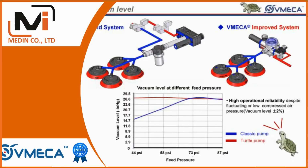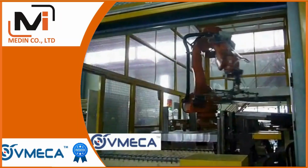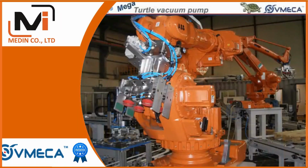Finally, we look into our vacuum level at different feed pressure. As you see, the typical vacuum system will drop in vacuum level as your feed pressure decreases. Now, as you see, the performance of the turtle pump is very constant and consistent with changes in air pressure. As many of you may know, you may not be getting the proper feed pressure in your current lines. This may be due to having too many vacuum lines or pumps running at the same time.